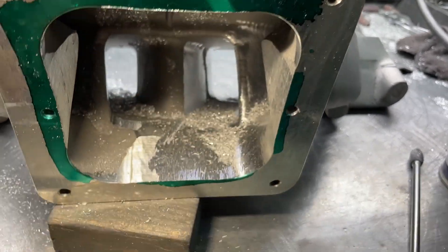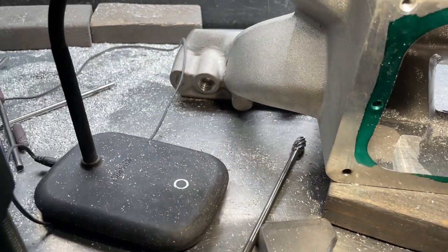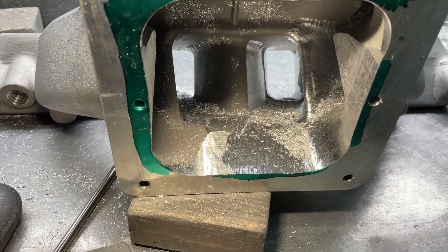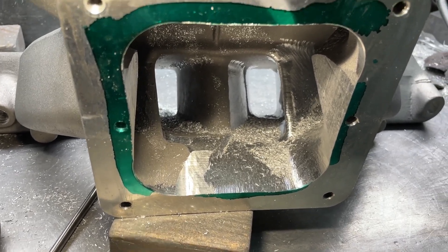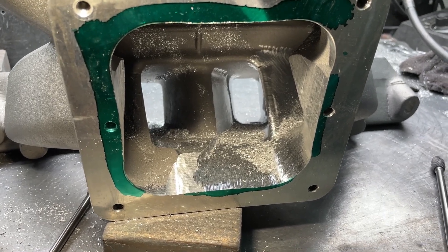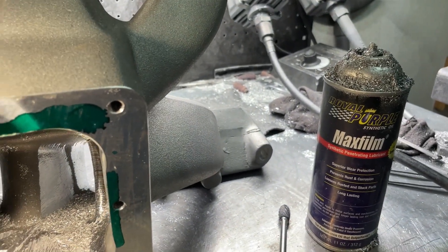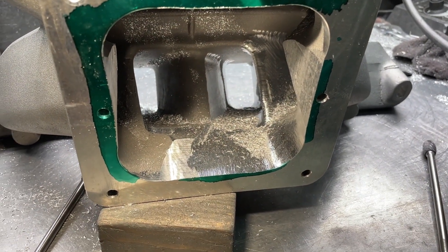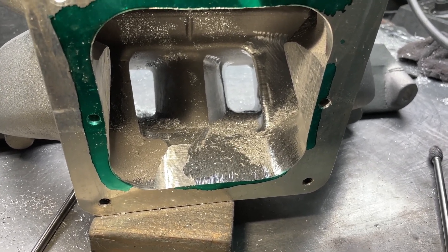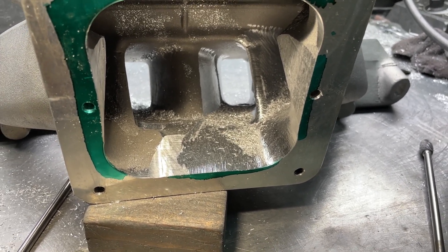Some people fog the whole burr before grinding — they'll take WD-40 and spray the whole thing, then start grinding. There's nothing wrong with that, except I have some safety concerns. If I fog it all up, that gets put in the airstream and I've got to breathe it, which is probably not the best. So I try to use the least amount to do the job. It actually cuts better with a slight amount of lubricant than completely wet.